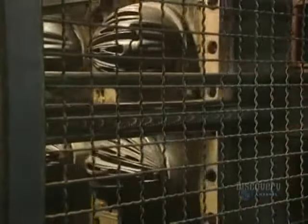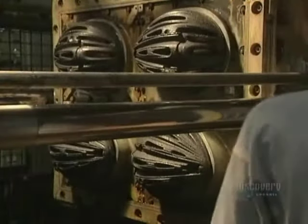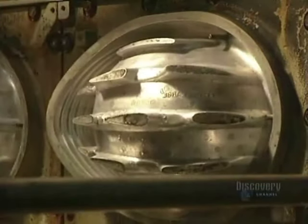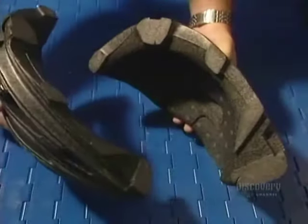The contents of this bin will be able to produce about 20 foam pieces, which will take shape on the molds. The press closes up for the six minutes that it takes to mold four foam pieces. The particles fuse with steam before being cooled with water. The foam is removed from the mold, and forms are produced for different helmets. Fusing of the particles has welded the granules to one another.